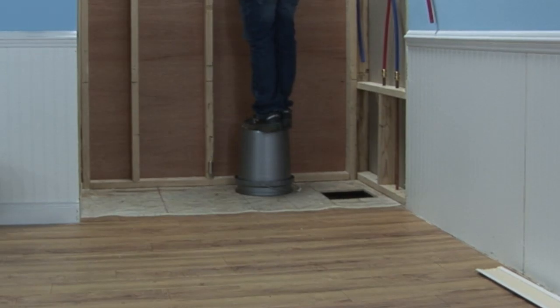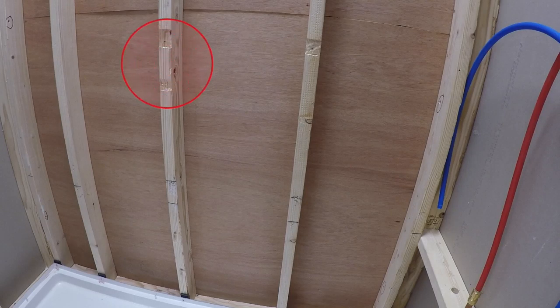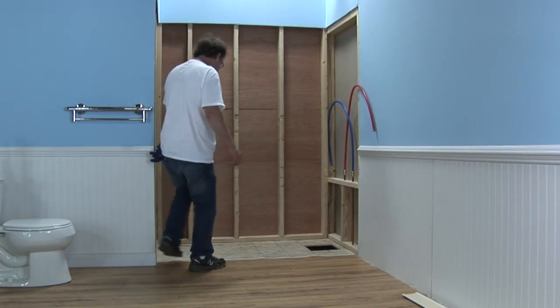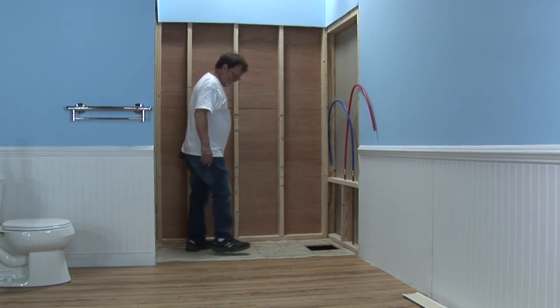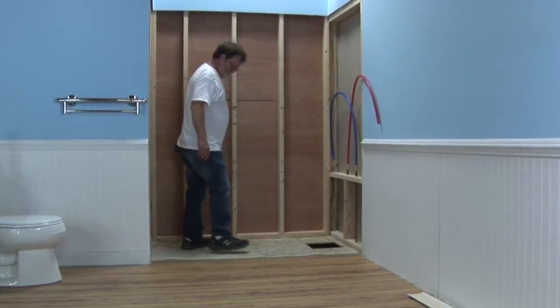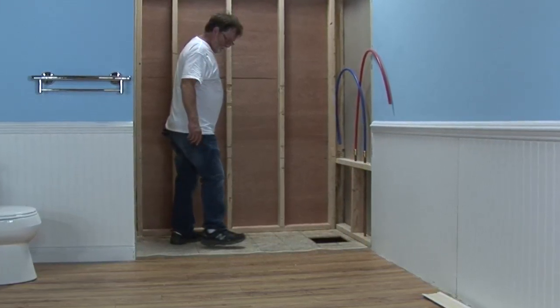In this demonstration, the wall was not plumb. A solution is to either shim the pan away from the wall or notch the stud. This is critical to a proper installation of the back wall panels. Slight variances will affect plumb walls and uneven grout lines. Inspect the subfloor for level and structural integrity. A solid, non-flexing subfloor is required. Strengthen and replace any weak or damaged subfloor materials.